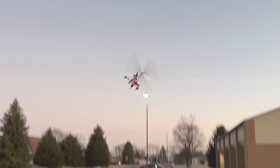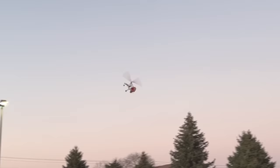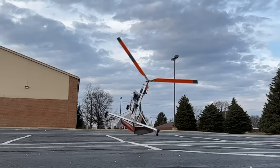The initial design flew with a three-bladed Delta-style rotor blade head. This was constructed of a flexible material such as G10 fiberglass plate that allowed the blades to flap up and down as it rotated around the gyrocopter. There's much more to attaching a rotor blade to the top of a fuselage than what one is led to believe.